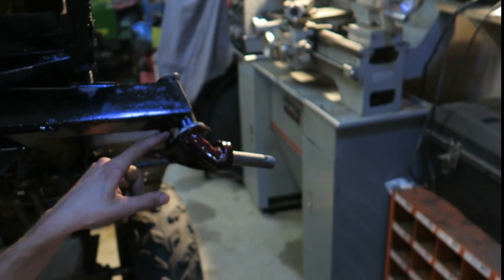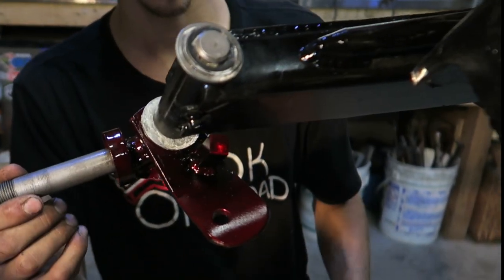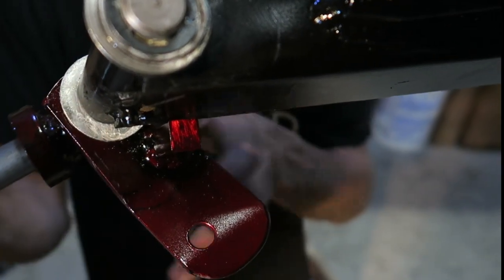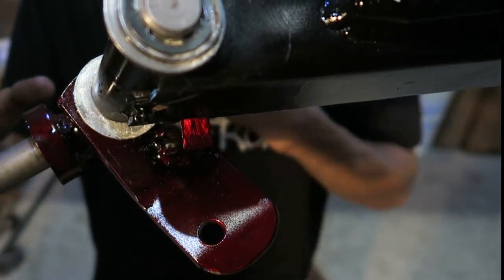Now, you might be wondering what this little piece of square is here, and you guys can see that on the backside of the axle, when this has the whole steering rack in it, this will hit flush. So that means the spindle cannot steer more than what it has set up now. You can literally turn that, just so we can see it hit flush.